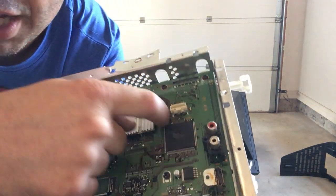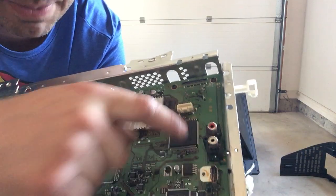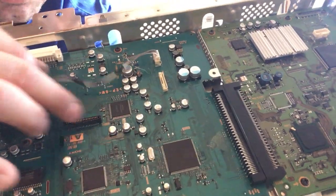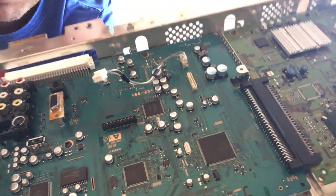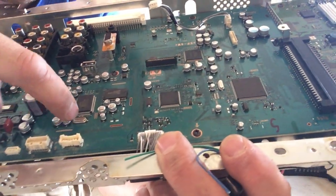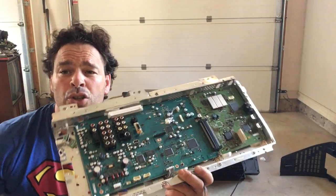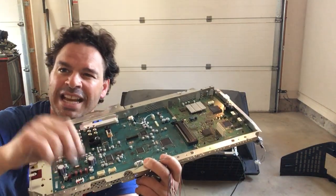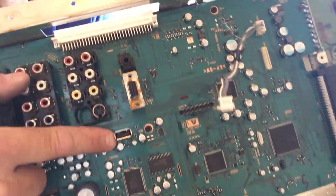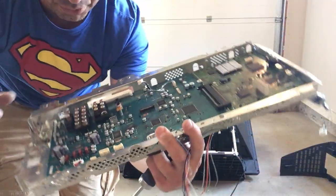These chips I'll cut around — Boardsort and online stores will buy them. I just take a knife, cut the teeth off, and separate them. There's also a gold chip here with a gold connector — I'll cut that off and collect those gold prongs in a small vial for gold recovery. There are also crystal oscillators here with a little silver, and USB jacks have gold-plated pins — I take those out as well and store them in a vial, hopefully to extract the gold one day.